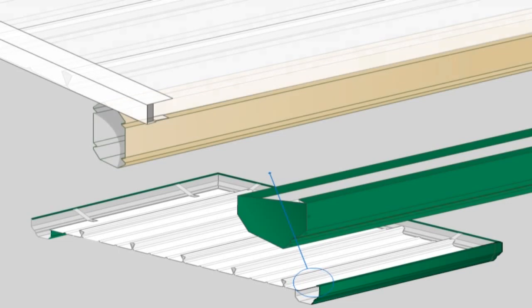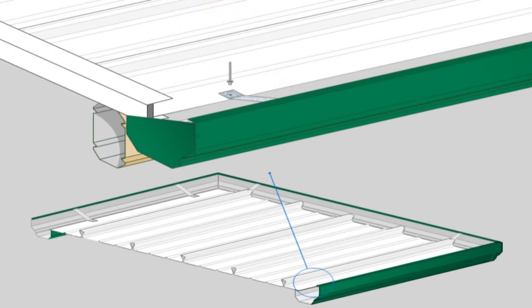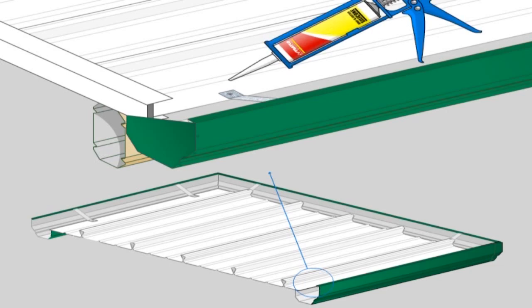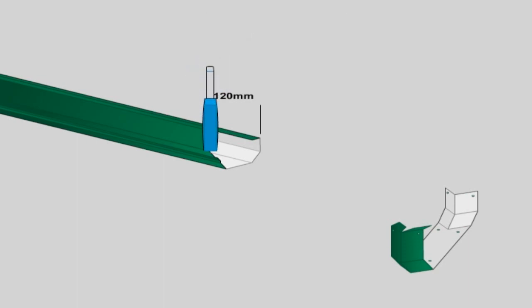First side gutter assembly. After fixing a gutter mitre to the corner of the first side gutter, lift the gutter into place so that the stop end slides up behind the back channel. Use rivets to fasten the gutter's back lip to the roofing at maximum 1m spacings and install gutter straps at least every metre. Apply silicone to waterproof all rivets. Ensure that the front face of the gutter remains vertical and even. Cut a 45-degree mitre on the ends of the gutters and fit the mitre using 3mm pop rivets, then waterproof with silicone.